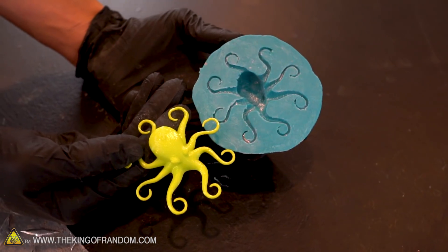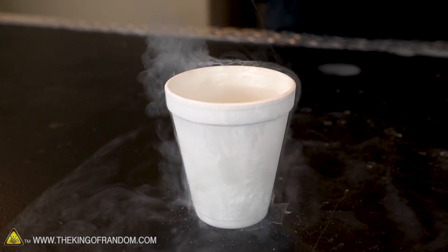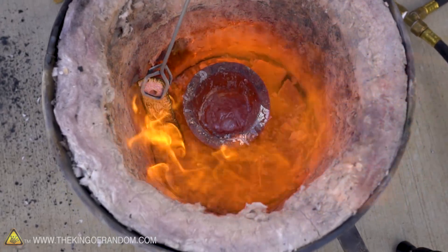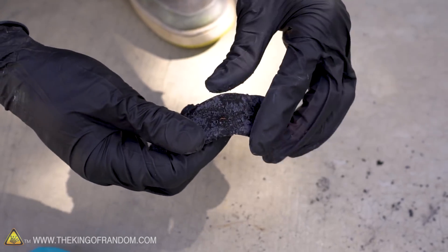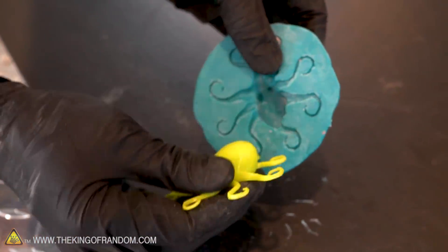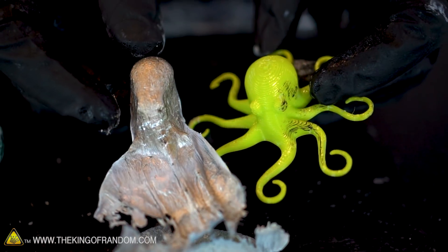There you have it guys — four different experiments with proto-putty. We've tried freezing it in liquid nitrogen, burning it in a furnace, making a mold out of it, and casting liquid metal into it. We had some mixed results. Freezing the proto-putty in liquid nitrogen — I thought it was going to freeze, then thaw and return to its normal state, but in freezing it cracked and started breaking into pieces all on its own, and when it had thawed it was very fragile and didn't hold itself together very well. Burning the proto-putty went about as I expected — it charred, bubbled, and burned, smelled bad, lit on fire, and in the end it's not really good for anything. Making a mold out of proto-putty worked very well — we got a lot of detail from our 3D printed octopus and it would work really well for most kinds of resins. However, pouring molten aluminum into that mold did not work well — the proto-putty just lit on fire immediately and the metal casting didn't come out well at all.